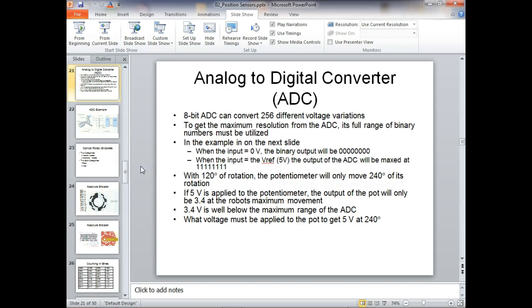There are all kinds of presentations on binary and decimal that show you how to convert them. Just go online and look up converting binary to decimal and decimal to binary. Well, that would be the best place to get the review. Our big thing is going from decimal to binary, because we're dealing with sensors here. We're not dealing with outputs. If we were going to outputs, we'd have to go from binary to decimal. But with inputs, we need a basic understanding of decimal to binary.